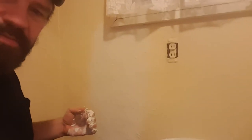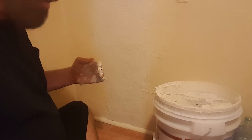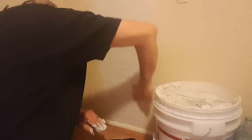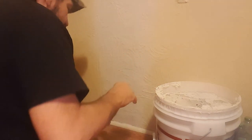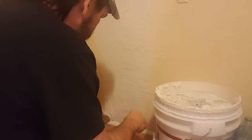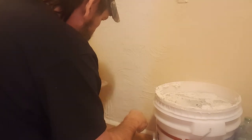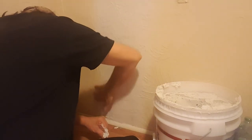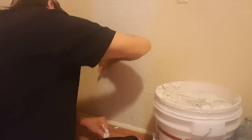I've got a larger line here — I can't really move you guys but I'll try. You can see in my old texturing where I went this way, but before that I went this way, so I want to bring that continued on. I think I might have to add just a little bit more on the side to bring it out to look like the rest of the repair, and then follow the same patterns I've got.